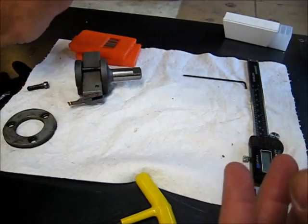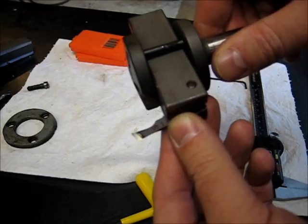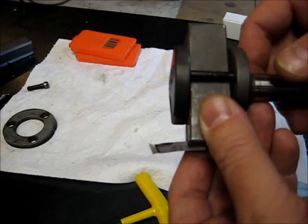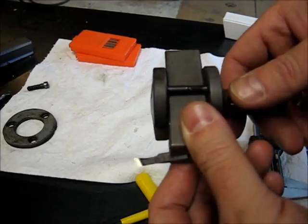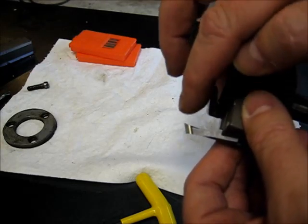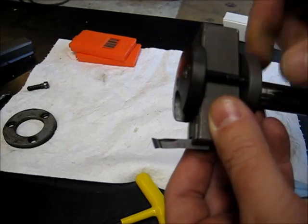and this is the bar mounting. And I actually find that the cutter clamp side is easier to adjust. But for doing small OD, this works real well. So we're going to get set up now to measure our distance here, so that we can set the tool up for the 2.23 OD that we're going after.